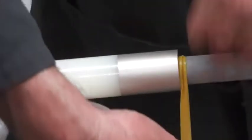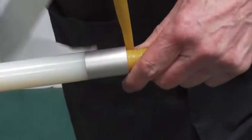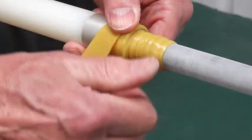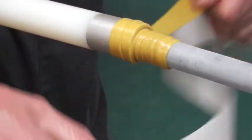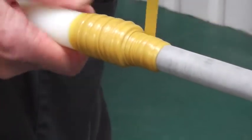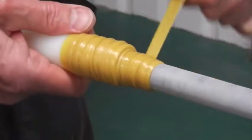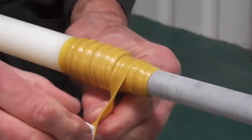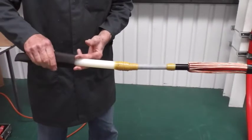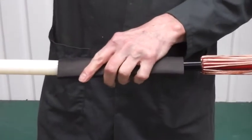Now take the bigger roll of yellow stress-relief mastic, stretch, filling in the gap between the nylon insulating rod and insulation of the cable, tapering up to the rod, over the applied screen and then back again so that we have a nice smooth taper from core to the insulating rod. It would be advisable to have some help from a colleague so that the rod remains in position.